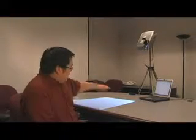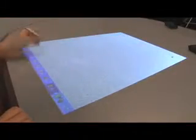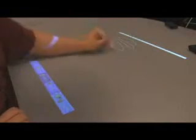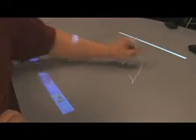And the Wiimote is actually attached to the projector, so we can have this top-down view of this display. Again, after I do the 4-point touch calibration, I can now use my pen just like a mouse, and I can interact with my table like it's a multi-$1,000 interactive whiteboard. Additionally, because the Wii Remote can track up to 4 points simultaneously, if we use 2 pens, this is actually a multi-touch interactive system.